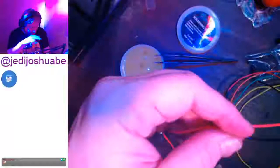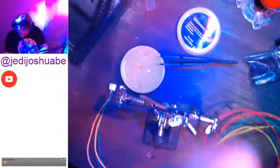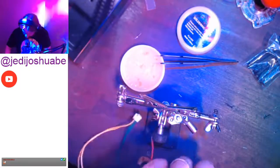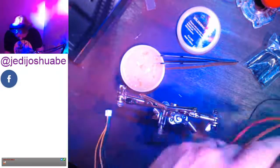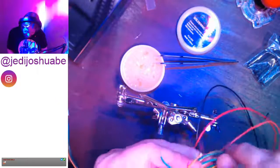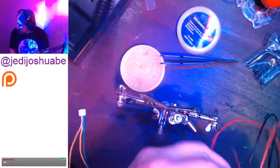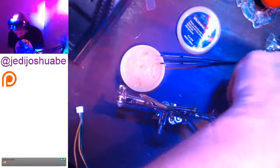All right. Oop, let me hit your main so you can see what I'm fiddling with. When you solder and there is something attached to it, you have to go through the wires and make sure that they're straight before you do the next solder. You can do it with one wire, but then you do another wire and it can wrap the previous wire. So now I'm going to take these and roll them tight. Let's see if I can get that in here. With these types of things, there's no reason to snip these wires at all. I could eventually need them if the other bumper goes out. This thing's kind of wonky, but it fits in the case right, so it may work.